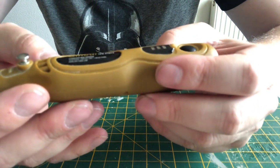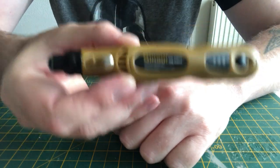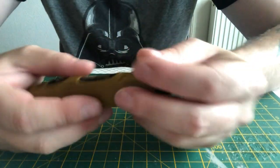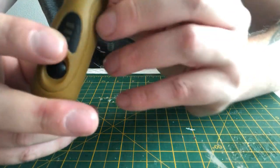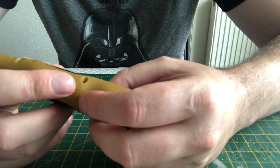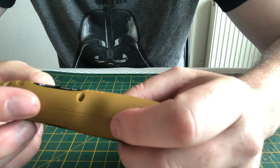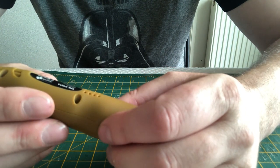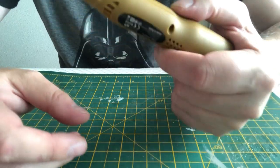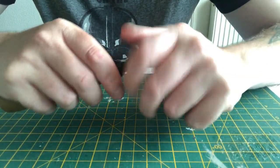The brand name and model number is TPK-PT014 if anybody's interested. It's a really good little tool — great to hold like a pen. It has three speed settings: slow, medium, and high. On the back it says made in China, 3.5 volt rotary tool with a standard charge plug on the bottom. No-load speed at the slowest is 5,000 RPM and at the highest 15,000 RPM, which is more than enough when dealing with plastic model kits.